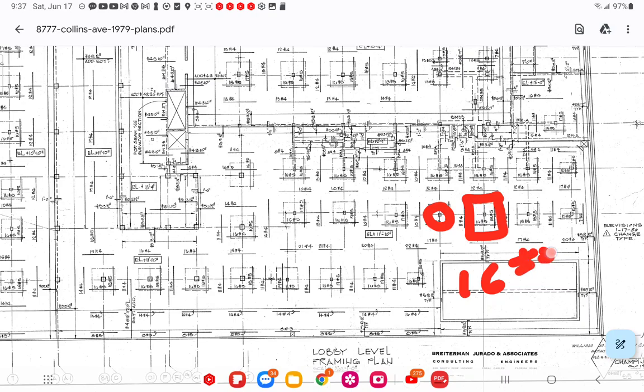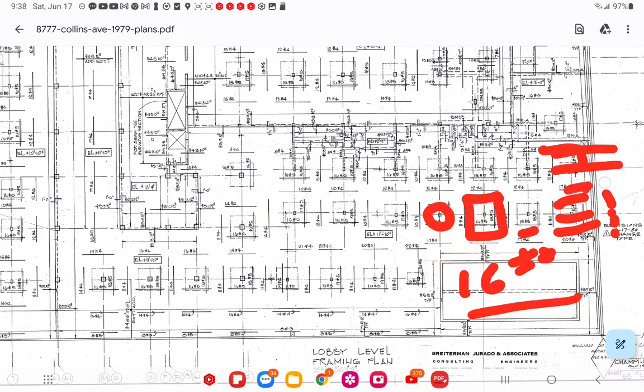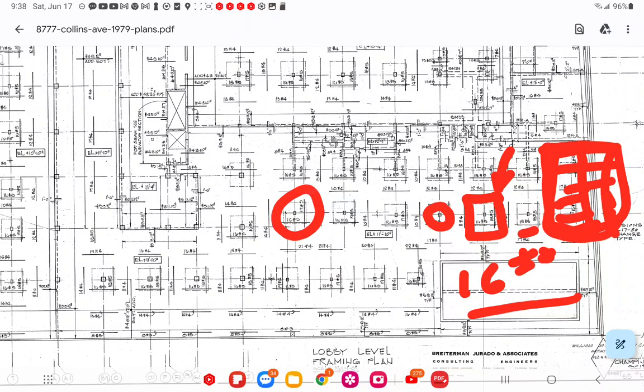In that direction since it usually goes this way, it'll be 16 of them and the center of the column would be going from center column outward, so you'd get a total of 16 in that direction. The opposing direction, I think, says 18 number fives — so nine on one side, nine on the other — and that makes that huge, beautiful critical shear zone, very strong boxes. All of those are the critical shear zones.